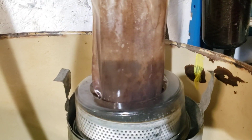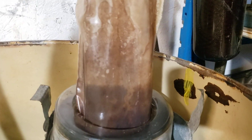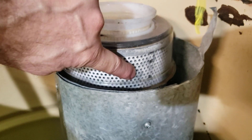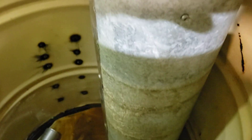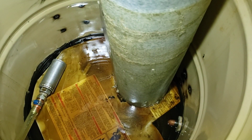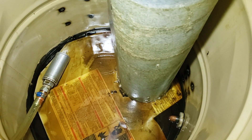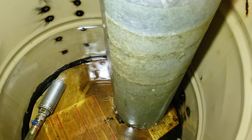There is 1,300 liters of oil through that, and there's lots of junk in there, but there's still lots up top. Below that, there is a 20-micron hydraulic filter — two of them stacked on each other inside a pipe — which goes down to a false floor. The oil drains down to the bottom where the water should be left, and the oil rises from the bottom up, so all the water can be left at the bottom.